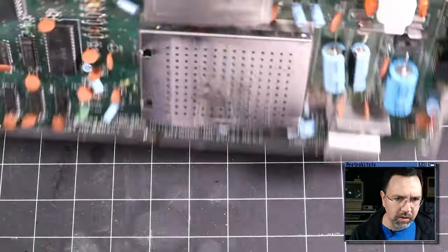That is a massive bummer. I wish it was something easy. I wish it was a simple RAM chip or even a PLA where you can get any number of cheap replacements, but not the 6510. That sucks. Well, you know what that means, guys. It's time to mark it off. Here's the bad 6510. Here's the Sharpie. There's the X. Job done.